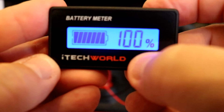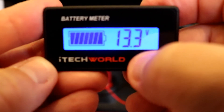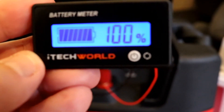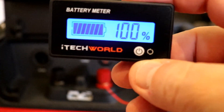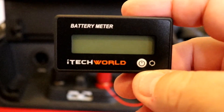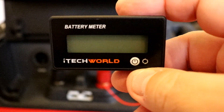You can scroll between what you want — your percentage or your voltage. With lithium you've got to use the percentage, because your voltage will stay constant — it'll stay at 13.3, 13 volts — till it gets to about 80–90%, and then it'll sort of fall off a cliff from there and start going down real fast. That's not a real good indication of how much capacity you've got left in your battery. You really need to work one of these in. These aren't bad — that was I think $49, got another sort of 10% off. All of my reviews — things I'm interested in — I buy them all myself. There's no sponsors, nothing like that.